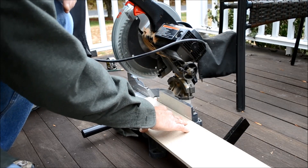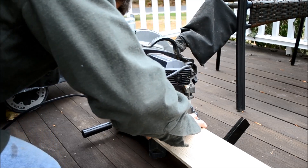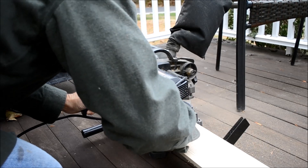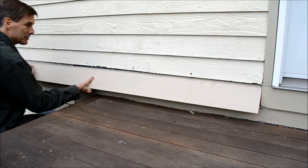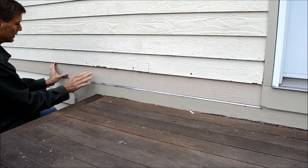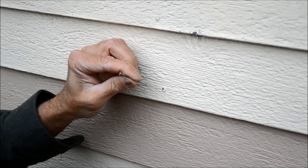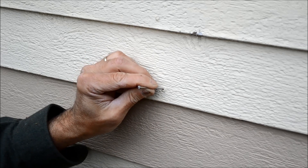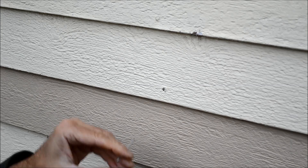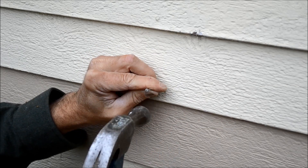Now I'm using my chop saw or miter saw to trim a piece of clapboard siding to the proper length. Now I'm sliding the new piece of clapboard up and underneath this clapboard and placing it flush with the surface of the sheathing. All that's left to do is nail it in place, so I'm attaching the new clapboard to the wall by first putting in one and three-quarter inch stainless steel siding nails, about three-quarters of an inch from the base of the clapboard above. I'm going to put two nails into the spot because I removed the nail from this clapboard, so the hole is a little bit wider, to make sure I've got a good surface area to secure this clapboard to the sheathing.